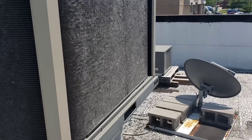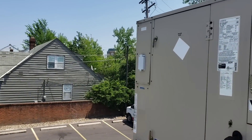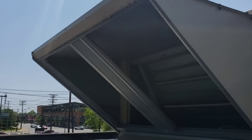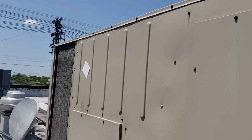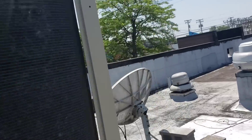So apparently this thing's not cooling, starting to get some cottonwood built up on there. They have another company, a maintenance company, that comes out here and does all their cleaning, changes their filters, blah blah blah, which would explain why these metal mesh screen filters are gone. I'll make note of that, but we don't do anything with that. Visually, I can hear a condensing fan motor running — at least one, maybe two — feels like they're both running.